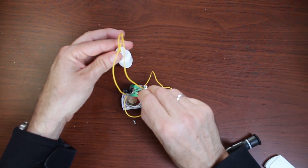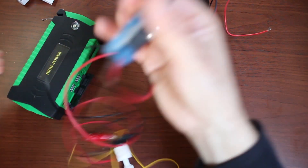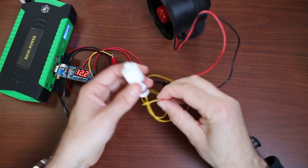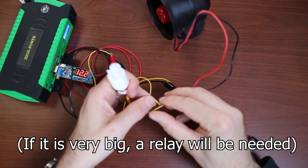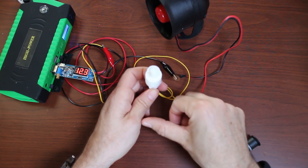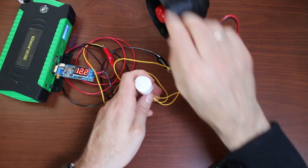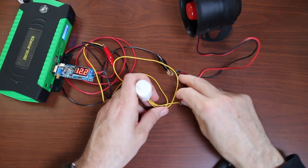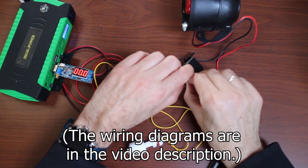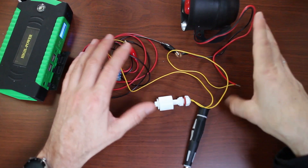Another option for those hard of hearing is to use a louder alarm connected to your battery or 12-volt power source. One end goes to the magnetic switch, the other to the negative terminal of the alarm. This alarm consumes quite a bit, so if you connect it directly the switch might burn out when water triggers the float. If besides the siren we want to add something else — like the bilge pump — we can't connect it directly; in that case we use a relay. The relay is connected here, and the new switch becomes these two contacts, which we use for the outside. With this, the mechanical part is suitable for when we are on the boat.